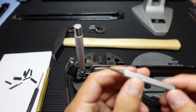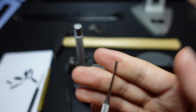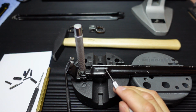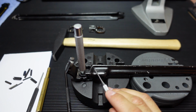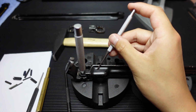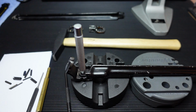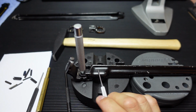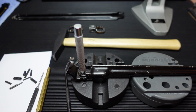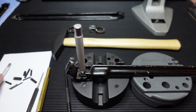Now if you remember, I used a pretty standard ordinary flat face punch, and the issue with that is that since the pin is mostly flush with the delicate anodized aluminum surface of the bipod leg, you risk slipping when you start the pin out, and this might risk gouging the edge of the hole, or even worse, leaving a fat scratch on the side of your bipod leg, so not optimal for obvious reasons.